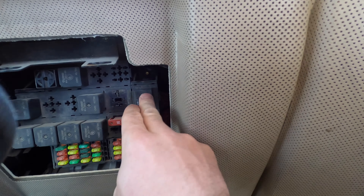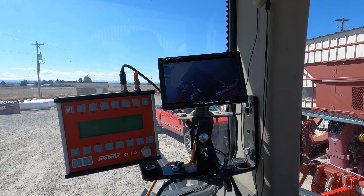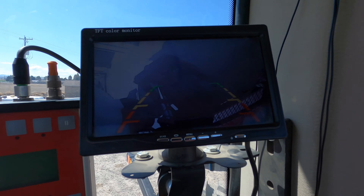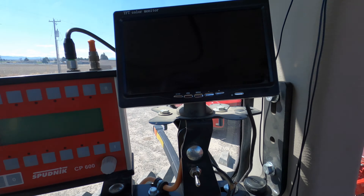It's supposed to have a little cover like this on it. I stole this one out of the AC circuit that's right next to it - I don't need AC right now, just gonna test it and throw this in there. Now let's see if that works. That didn't fix it. All right, hopefully now I've found the problem - got a burnt fuse. You can see in there it's burnt off. I checked it with the ohmmeter - no connection.